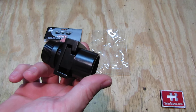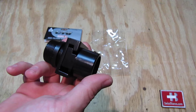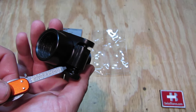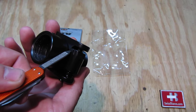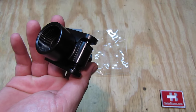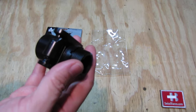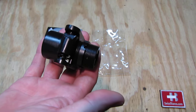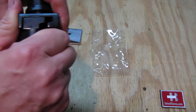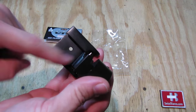On top we see the folding stock hinge part in the open position. There is still some space here and here — we can see the engaging surface on the flat side, so there is plenty of space for wear. On the other side — maybe the more interesting side — we have the spring, the angled corner, and the gap that would still allow the hinge system to wear in. As you press that down, you can fold it over.